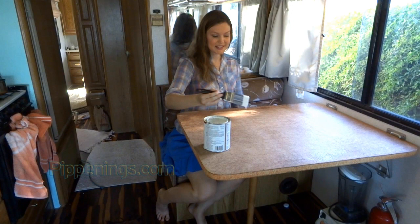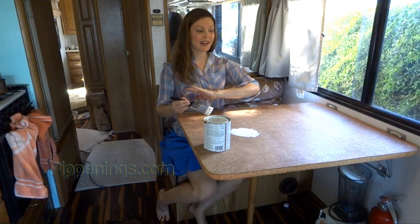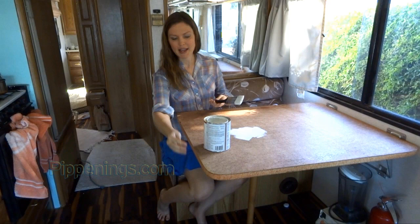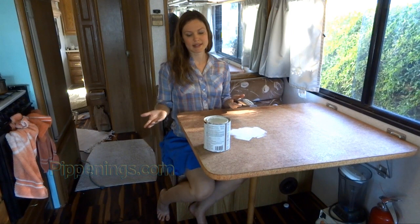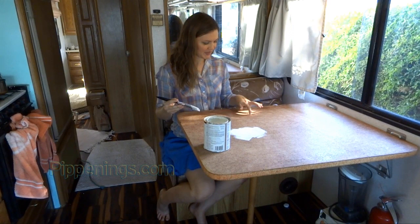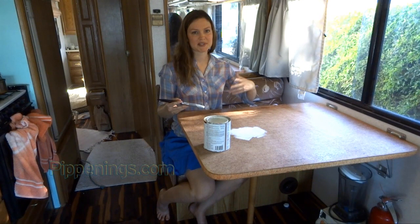Since this texture is going to be completely covered and then have a new surface from the epoxy, I'm not going to worry about sanding it. It's going to be painted after the primer. I don't even really need to use primer, but I am, because I won't get the epoxy on the sides. I'll have to paint that separately with polyurethane. And since the polyurethane's like 1/700th width of the epoxy, I'll paint the sides with primer. So I had to get out the primer, and this stuff might totally suck up the paint. So the primer helps me not have to lose all my paint into the wood fibers.